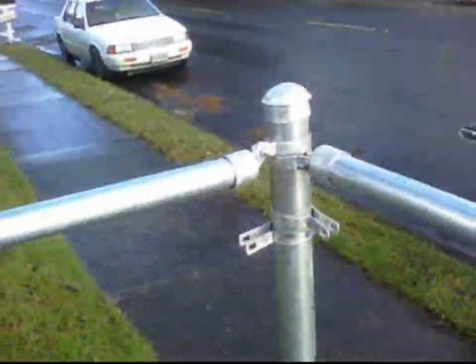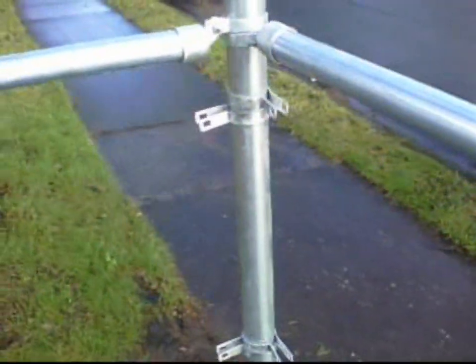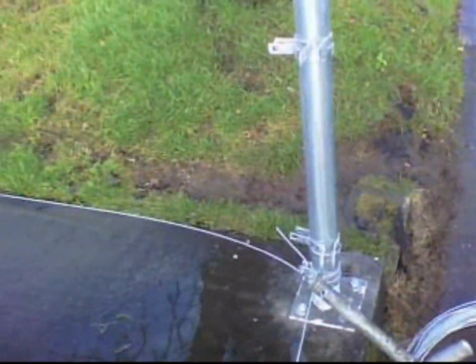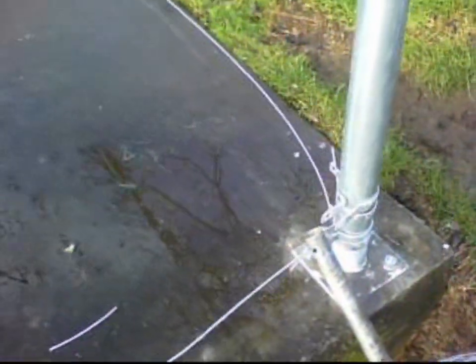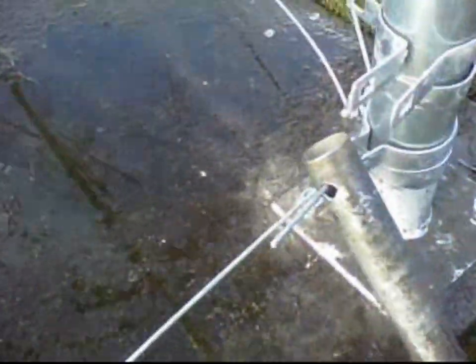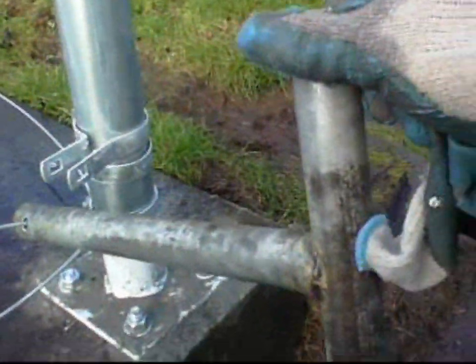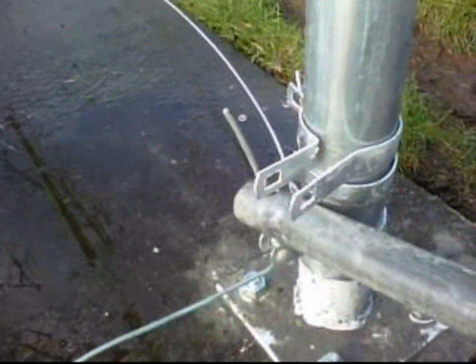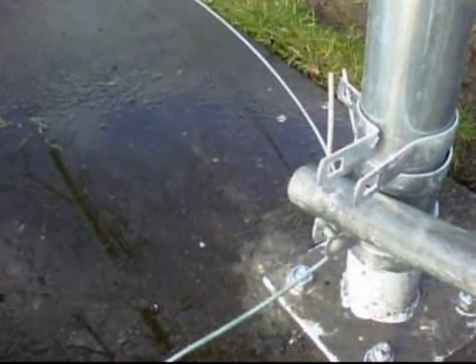Once I got the rail in, you can tell it's straight. I got the bands going in the correct direction. I'm about ready to stretch the tension wire. Now seeing as it's a simple job, I really don't need anything more than what's called a little T-bar here. This T-bar is what you're going to want to twist against or away from in order to tighten the tension wire.